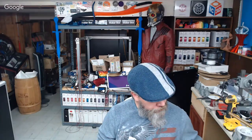I'm going to slide an extra little shim of metal in there. I'm going to clamp down a piece of bar stock across it, and I'm going to run as steep an angle as I can from side to side on that overlap. Oh, I got you, to make the seam, so it won't be a straight seam. It'll be an angled seam, so it'll roll nicer. Then I'll very carefully adhere that down, and the belt will be done. That's basically the last thing I've got to do other than playing around with fine tuning.